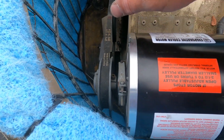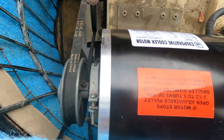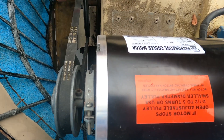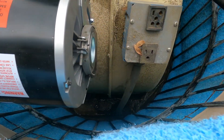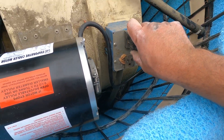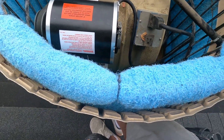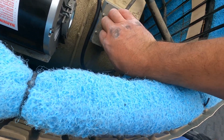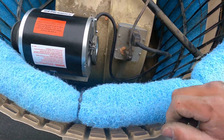Just to recap: make sure that you have your Allen key nice and tight on the inside of the pulley. Next, make sure the support clamps are nice and tight and grab the teeth — if these are loose, the belt will fall off and the unit will start to shake. Let's go ahead and test it out. Now you can put your water pump back in. Everything looks good.